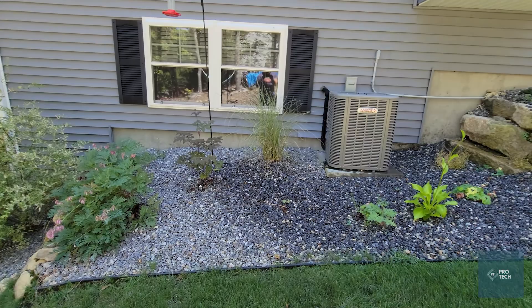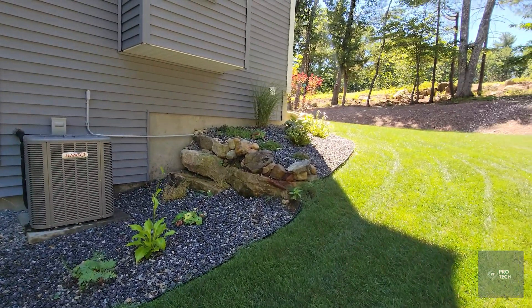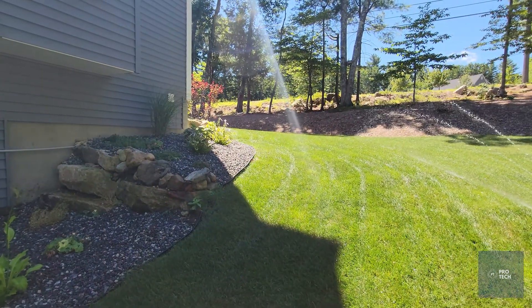Essentially, it does the contour of your grass. You've got maybe a heating or air conditioning unit that you don't want to spray, or a car — in my case that was one of the reasons why I liked this. There's also the other benefit of a digital head: there's no waste. They're not overlapping 50%, which is what most irrigation companies do. They put a whole bunch of sprinkler heads which covers the grass, but then there's all this waste because overlapping areas get too much water.